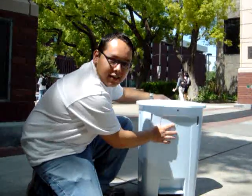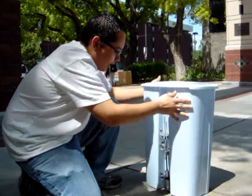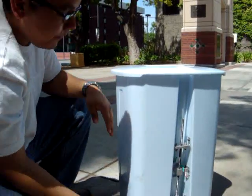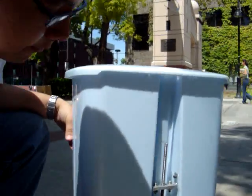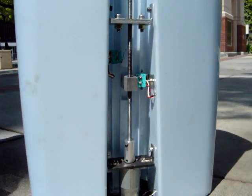There's an LED switch — which you can't see because of the sunlight — and there's a proximity sensor. If you look at the back, we have an ACME screw that we constructed and two limit switches, with 24 volts going through this motor.